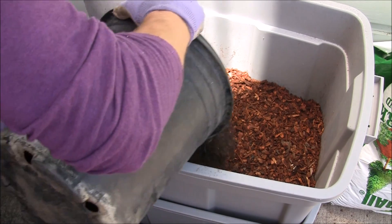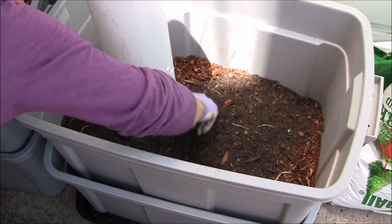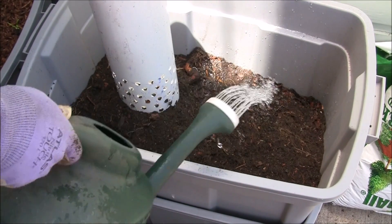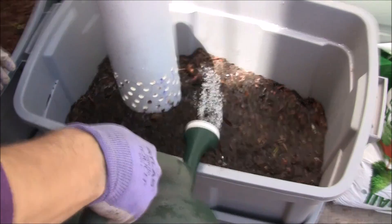After these wood chips we're going to start with the soil. As you add it you do want to wet it down — if you keep it dry you get settlement where it all comes down the next day. I'm going to keep adding more soil and watering, and I'll be back when we're at the top level.